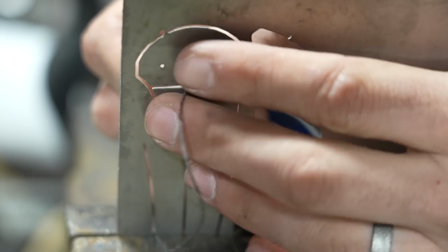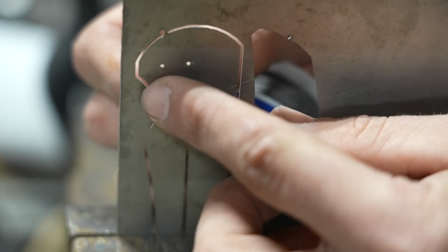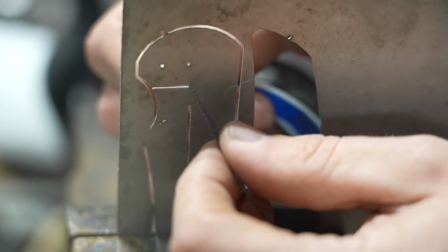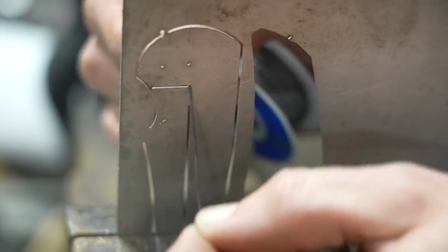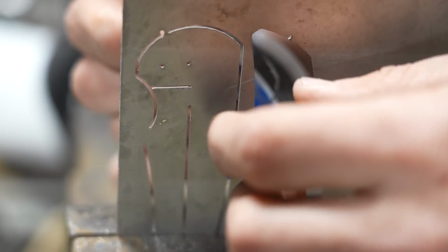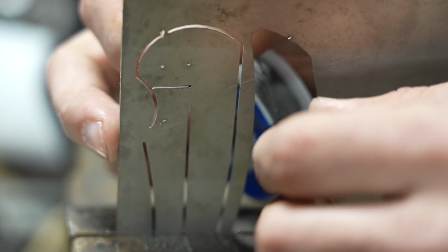Now this is titanium, so you're gonna use a good amount of aluminum oxide cord if you're trying to finish a part like this, because titanium is particularly hard on abrasives. But the idea that you can actually get in here and do any work is something that you wouldn't be able to do without something as versatile as an abrasive cord. We can even get into these pierce holes with this very small cord. It's like threading a needle.